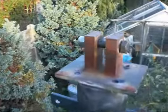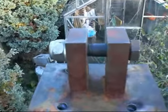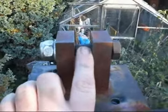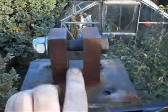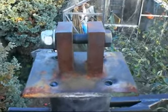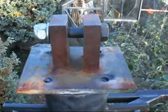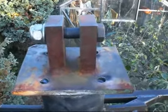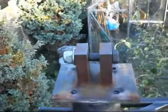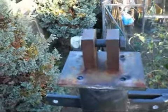On the top I've also done an improvement. The bracket off the frame is at the engineers at the minute, and I've replaced the bolt with a bolt called a set screw. What he's going to do on the other piece is put a screw nipple, so I can get an oil gun and inject copper slip or anything else into the bolt anytime I want, to stop it seizing up. He said it's the best design. He said everything seizes up. If you put a pin in, that'll seize. If you put anything in, that'll seize.